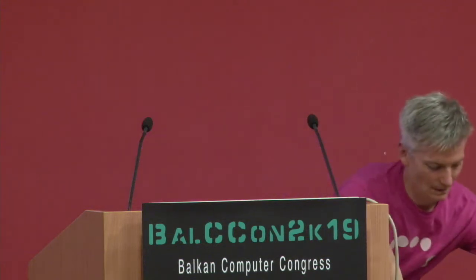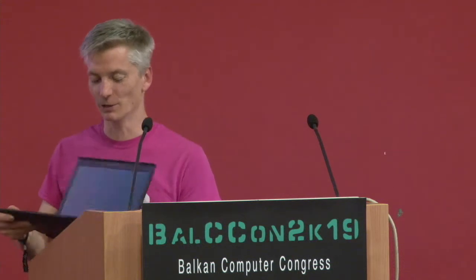Question: The ThinkPad that you flashed to a new bootstrap — are you going to flash it back, or is it going to flash itself back? There were no changes made to the ThinkPad. Once the clip is removed, it will boot from the usual flash. So it's useful both for firmware development and evil maid attacks.